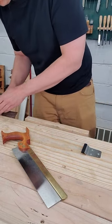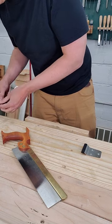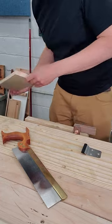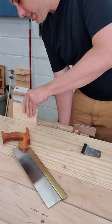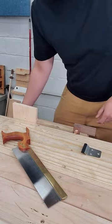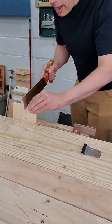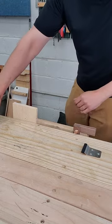I'm just going to put it next to my board and stack up something approximately the same thickness. I'm going to stick that thickness in there on the other side, and it does exactly what it says — it just stops the vise from racking. Now this board is held really well. Get in there and dovetail it, no problem.